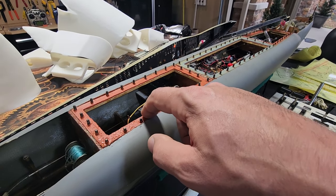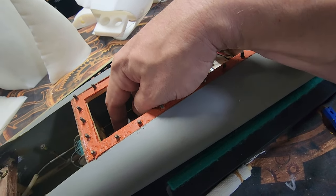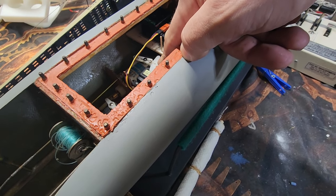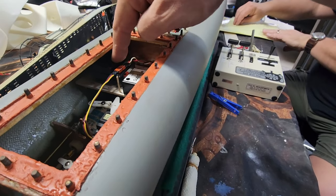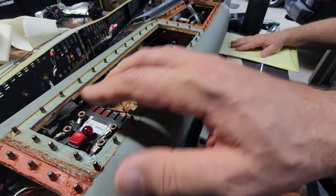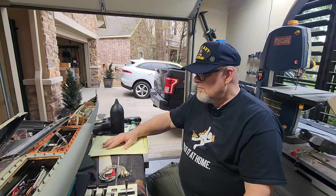All right, we figured out these seals actually feel pretty good, nice and chewy and gummy. We've got this broke free, so that's like 2 seconds to fix. The fail-safe servo pulls the pin, drops the weight. We got our rudder servo, I think. No, dive plane servo and rudder servo, the sub-safe, and the electronic speed controller. This is all good. And then we figured out power distribution, two big sealed lead acid batteries. 12 volt, 7 amp hour sealed lead acid batteries is what it was set up for.